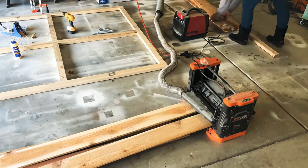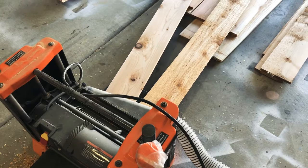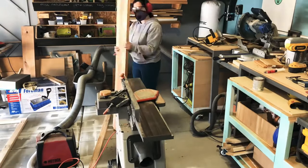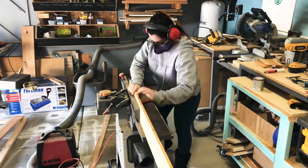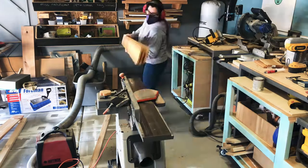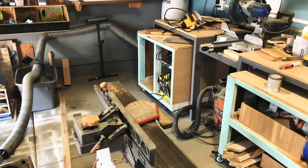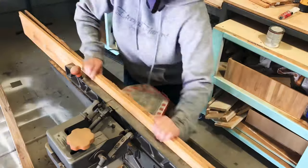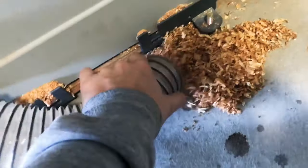Next I grabbed my planer — I wanted to clean the cedar boards up a little and make sure they were all about the same thickness. These cedar boards were great because they're inexpensive and super light on the frame, which was one of my major concerns. However, they are crooked and don't have a smooth edge, so I ran them through my joiner. If you don't have a planer and joiner, I'd suggest going with 1.5-inch ply cut into strips for a straight edge and smooth finish surface. Also, a quick safety plug: make sure you have ear, eye, and mouth protection whenever you're working with power tools. Protect those eyes and lungs — keep your glasses on and keep everything protected.